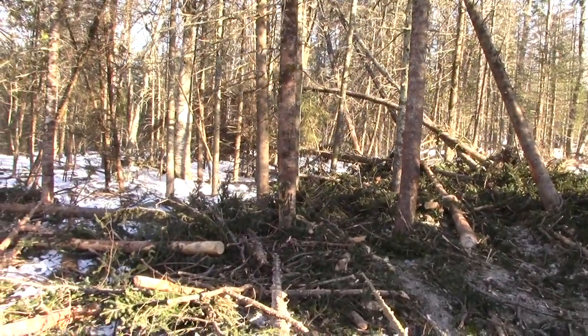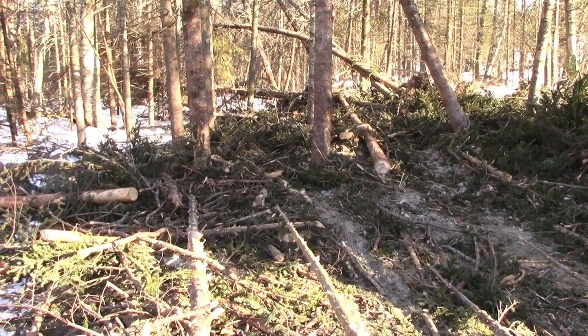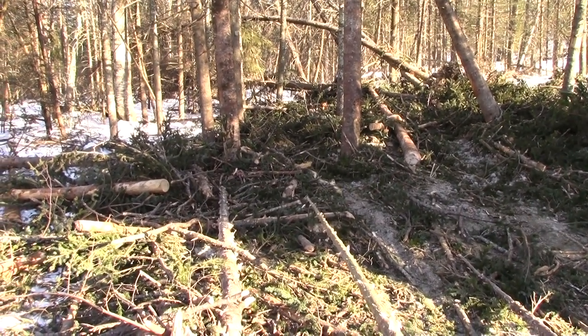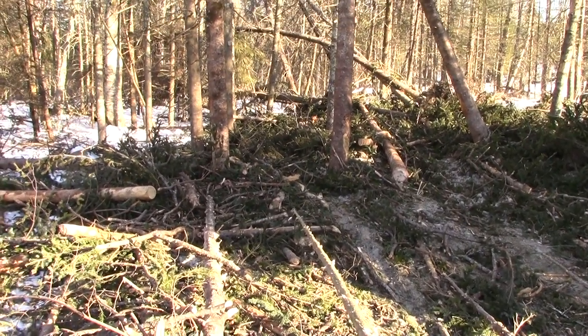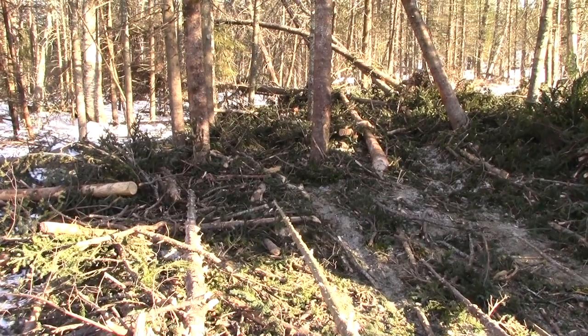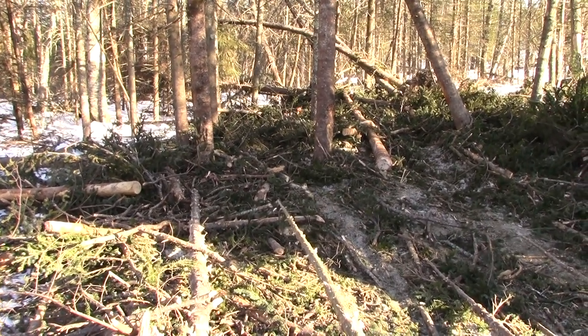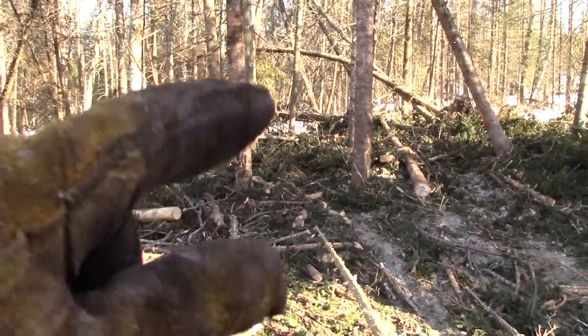Like I said though, the trees that you're backing into, you gotta cut them when you're done. The junk, you're doing this. And if a forester or somebody comes in here and you leave it like this, you won't get any more jobs. But this is how it's been done for a long time. And with a cable skidder, it's the only way to get production out by yourself. So don't be afraid to do it, but cut your trees down when you're done.